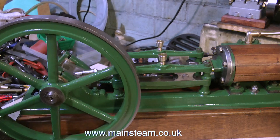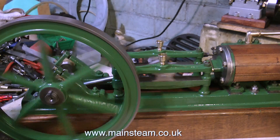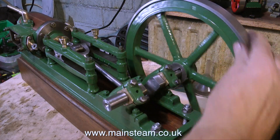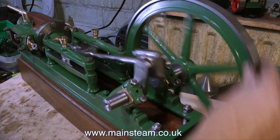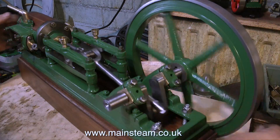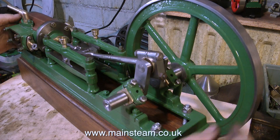I'm also noticing some rust around the edge of the front cylinder cover, which I also cleaned up recently. The rear cylinder cover is perfect, because that is a new piece of cast iron, which is probably of a higher grade. This is a temporary fitting of the flywheel, just to allow me to turn over the engine at a good speed to see what it feels like — and it feels great. No tight spots, and really free running.